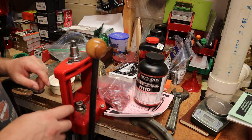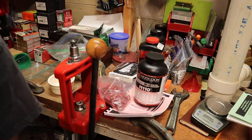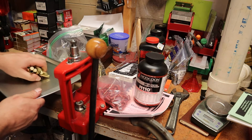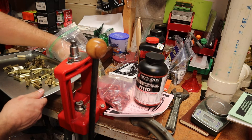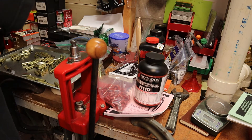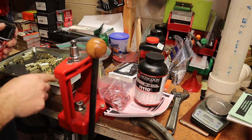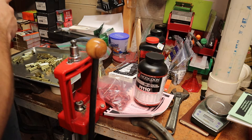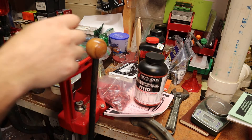The first step — I've got all my brass here. I'm going to pull out my cookie sheet and give it a quick wipe down. Then I'll take a couple handfuls of brass and grab our case lube. When you run your cases through a die you want to use some form of case lube. I'll give this stuff a quick little shot — that's all it needs. You can let it dry or not, your choice.